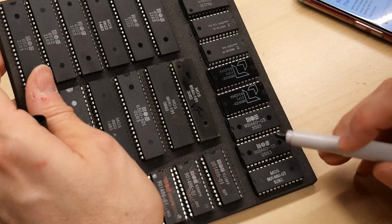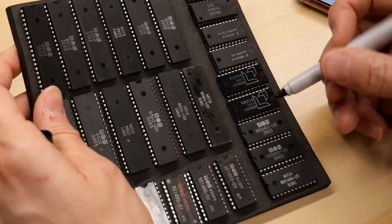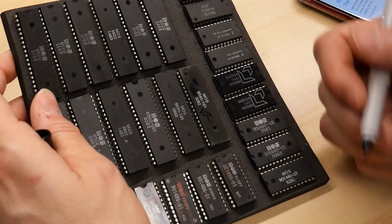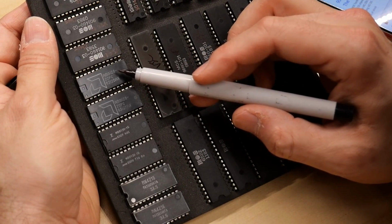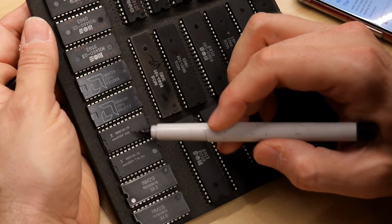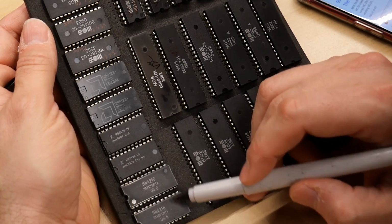All right, and these three ICs are 901460-03s. Well, I'm assuming, going off the theme here, that these are probably VIC-20 related. And yes, on my phone, I see that they are the character ROMs, and that just leaves these 6 ICs here. So AMD 9128-20s, 9128s. This is a 9128-15, 9128-15. These are Fujitsu parts. And then we have 4216s.